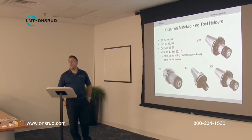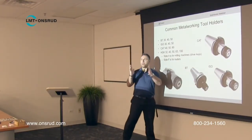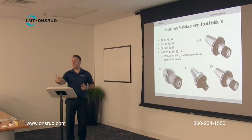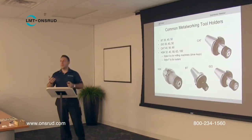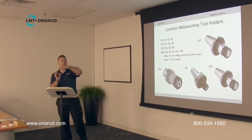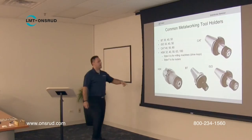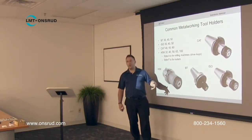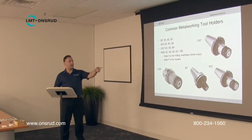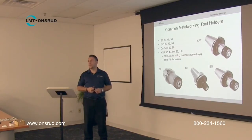Question: What's the actual difference between BT, ISO, and CAT? It has to do with the taper itself — some have slightly different degrees. The CAT, ISO, and BT are very similar visually, so sometimes you won't know which one is which until you look at the stamping on the tool holder. There are differences in length, diameter, and taper angles. Most CNC routers use HSK, ISO, or sometimes BT. You can ask Gary in the lab to show you an example of an ISO type tool holder.